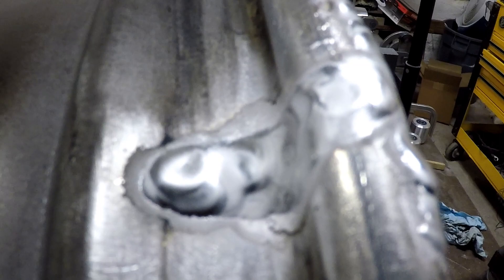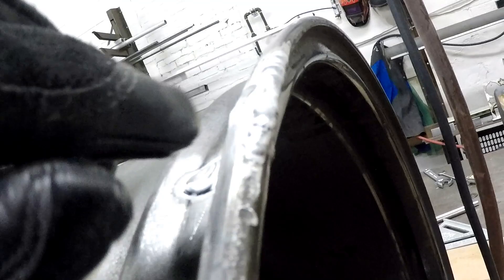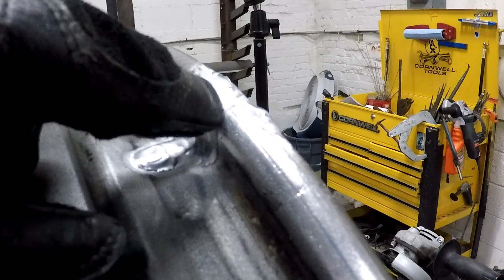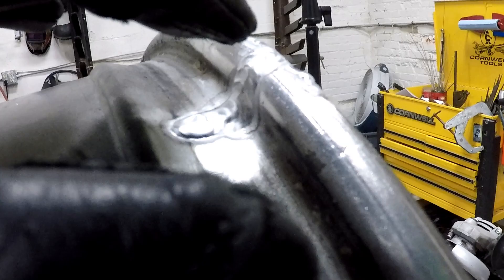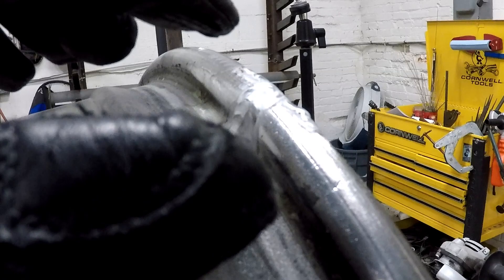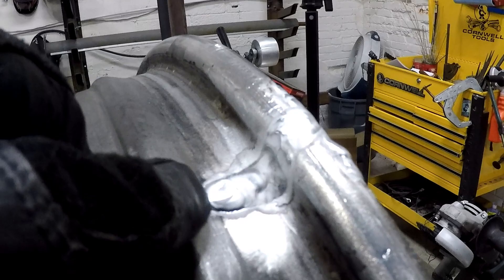Okay, we're looking good there - that did the trick. It'll be a lot easier to sand out right through here. Just need to let this cool now. Once it's all cool, we'll sand it out, sand this edge down. The beads build up a little bit - I can get that with a palm sander easily. This section I have to do by hand with sandpaper, which is a real pain. This could take me half an hour to 45 minutes to sand it nice and smooth. If you don't take your time prepping it and welding it right, sanding isn't going to help you. But once you do prep and weld it right, sanding will allow the tire bead to seat inside this groove. If you don't, it will never seat and it'll just leak air.